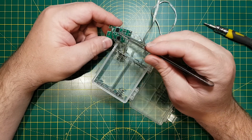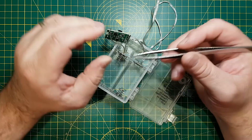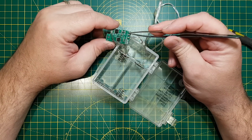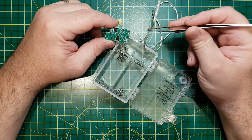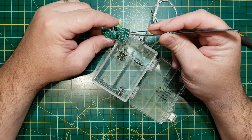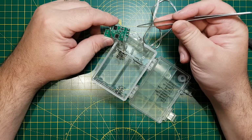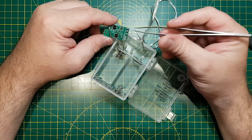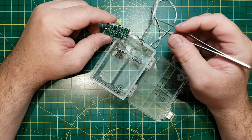And to do that, you can either use discrete transistors to connect them. So on output 1, you would have a PNP and an NPN transistor. One of them would be given the 5 volts out, and the other one would be given the ground when it's needed, and the same on output 2. When the PNP is engaged on output 1, the NPN will be engaged on output 2, and vice versa. And that's how it gives voltage out on this one and comes back to ground on this one, and then it flicks back and forward.